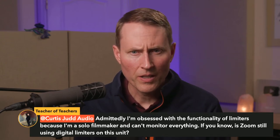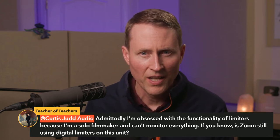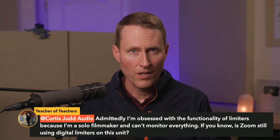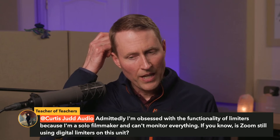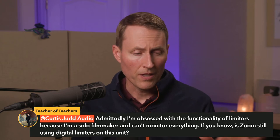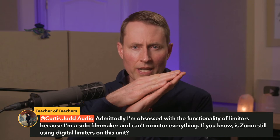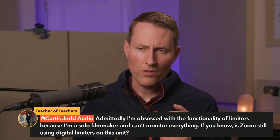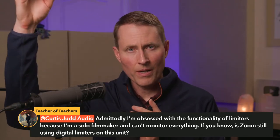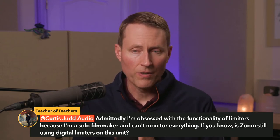All right, teacher of teachers, admittedly, I'm obsessed with the functionality of limiters because I'm a solo filmmaker and can't monitor everything. Is Zoom still using digital limiters on this unit? It's my understanding that they are, yes. The advanced hybrid limiter and the standard limiter are both digital. The advanced limiter has to be digital in particular because they're delaying the audio by a couple of milliseconds so that the limiter can react before a transient gets all the way up to 0 dB. So it's very much a digital limiter.